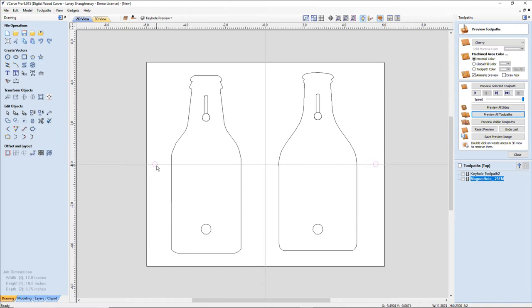Now, normally in one path or another, we are creating profile cuts, whether we cut all the way through when we flip the board over for the final cut, or we cut halfway through from one side and halfway through from the other, however you do. Now, I'm not going to through cut my alignment pin holes. Rather than through cutting them and then cutting into my waste board that 1 inch deep, which is a lot of wear and tear on my bit and that drilling and everything, I'm going to cut these holes halfway through, 3/8 of an inch.